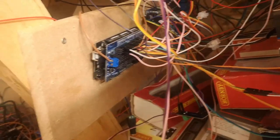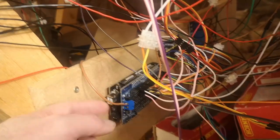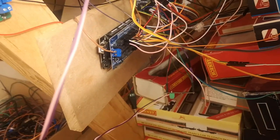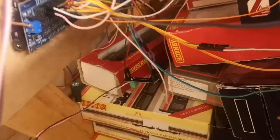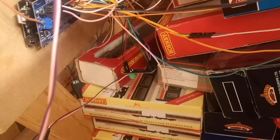Back up in the loft - this is node 3, where everything terminates. The ground bus cable comes all the way around and terminates in the ground socket on this Arduino, and there's an RS485 adapter down there where the bus cable terminates. I'm going to add my monitor node on the very end of the RS485 bus to allow for maximum error detection. I'll need to recable this - put splitters on the end of the ground and the two bus cables, bring droppers down into the RS485 adapter, extend the cable a bit further, and put the monitor Arduino right on the end of the bus.